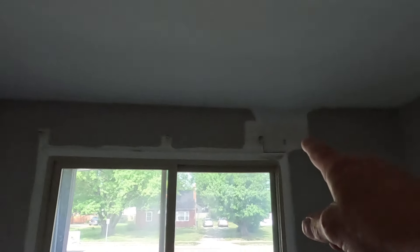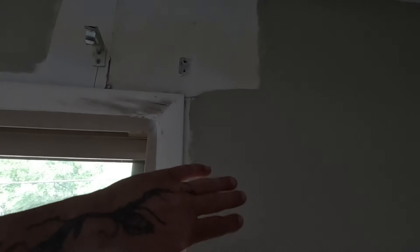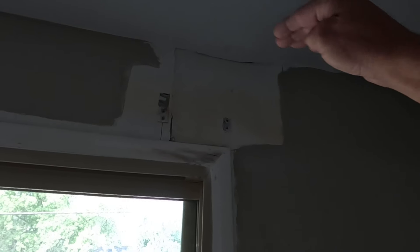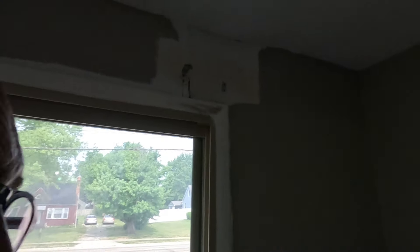When I'm doing a project like this I try to get everything I need, but a lot of stuff comes up. Like this spot up here — that's actually good drywall, it's just the seam that's popped, so it's got a little dip. I can float that out. What I'm gonna do is get my pole jack, crack the drywall, push it up, and put a piece of corner bead there to keep it from sagging back down. I've gotta mud that anyway. There's always something to fix — let's go get parts.